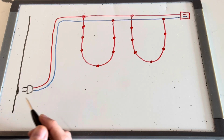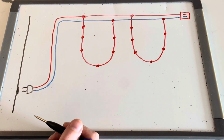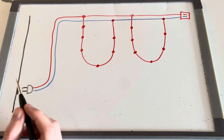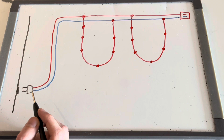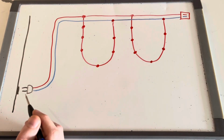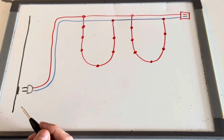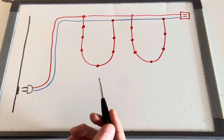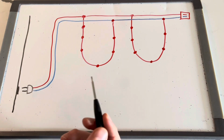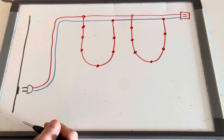Now, typically what you will see on a tree is that every once in a while a light bulb will not be lit up; it'll be burnt out. In those cases, these bulbs are designed in a way that they can still conduct electricity even if the bulb is burned out. So just because you have a burned out bulb doesn't break the circuit, but if you have a strand of 50 bulbs that are out, a full strand, that means you do have some sort of mechanical break. It could be a different problem with the bulb, not just that the filament burned out, but that there's a mechanical break somewhere in the bulb, or you have a mechanical break elsewhere in the chain. So what I'm going to talk through is what I did to debug the circuit.